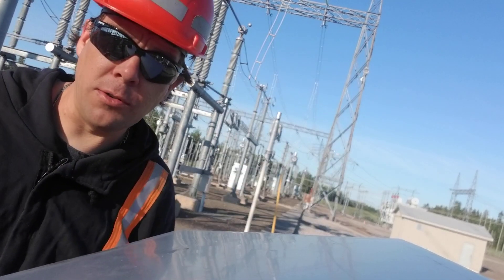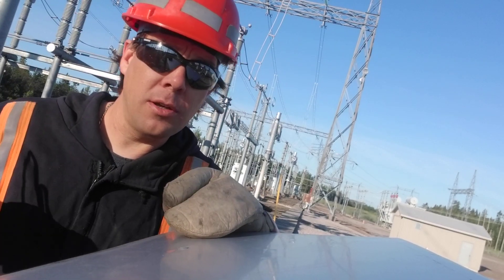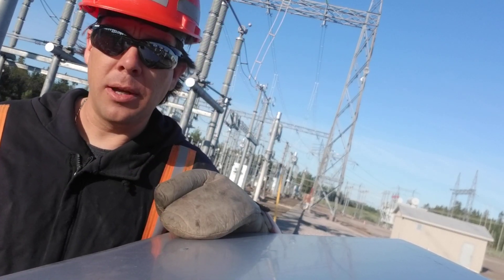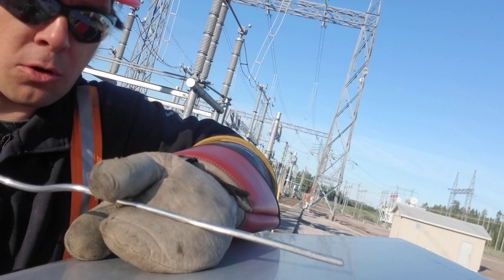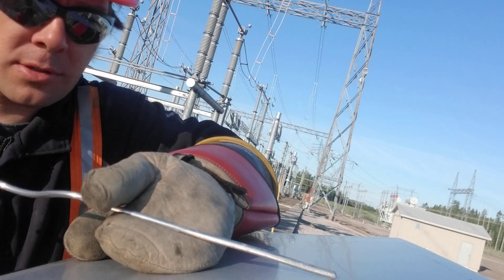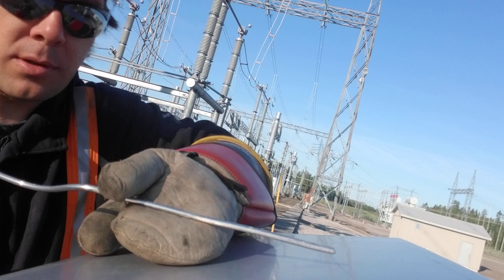Something that might take a few years to get used to, especially if you're working on transmission lines. That's why you've got to make sure you follow all your proper bonding and grounding procedures — rubber gloves when opening a gate, and don't put yourself across two metal objects of different potential. Thanks, guys.